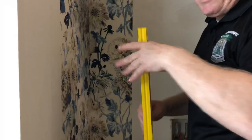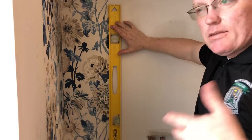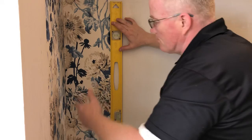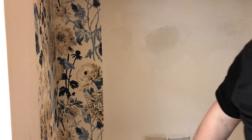Now you guys who hang — you're like, okay, is that straight? Let me see. The thing is, if it's not straight I get to stop the video and redo it — just kidding. We have 98% compliance, that's good. The difference to overlap this and make it ugly is negligible. This is acceptable because the corner is now perfect. We are going to move forward with this — my bubble is on the line. Good. Don't try to be God when you install wallpaper; you will fail every time.